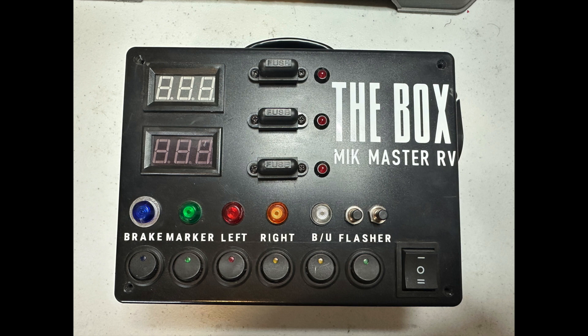There are a few features in here that you may not be interested in, but I put them in for a reason. One was that a brand started mixing LED and incandescent lights in the marker light circuit, and it would do weird things to the lights on the box, so I came up with a solution for that. Another brand started using the side marker lights as turn signals also — doing both functions — and I wanted a reliable way to test that.